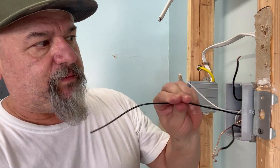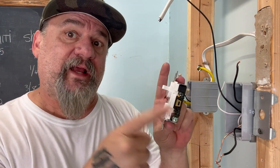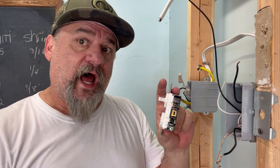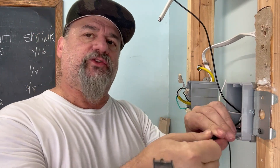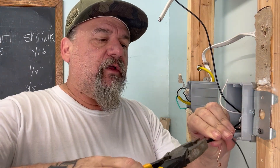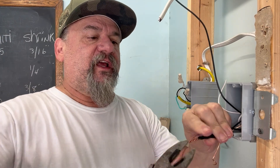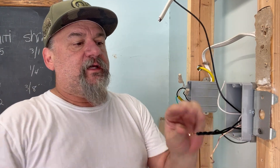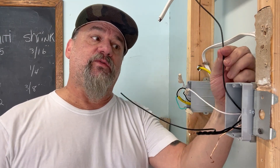We're going to pigtail down our hots, and the wire we put in is now our switch leg — that's the wire we ran and stripped out. We pigtail the hots down just like we did the neutral, to one hot. Power's coming in, feeding this and feeding that — feeding whatever it is downstream. So now we know we have the power re-feeding everything it was before. Nothing has changed; we just pigtailed it down. Now for the switch plug combo we have a hot, a neutral, and a switch leg.